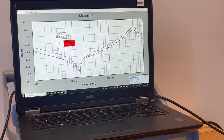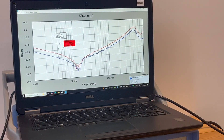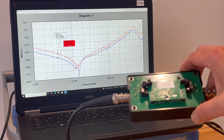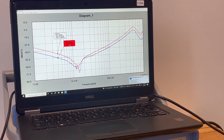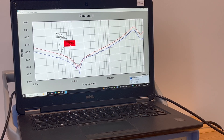This short video demonstrates the benefit of using the X2Y capacitor, and I hope to make a proper PCB demonstration next time to show you many other results. But from this simple demonstration using our jig, you can already see that the X2Y capacitor enjoys lower impedance across the whole frequency range. That's the message we want to send. See you next time!